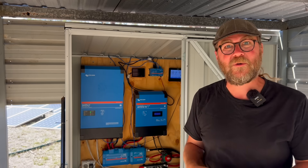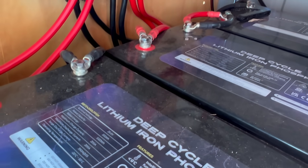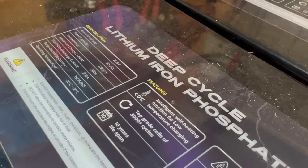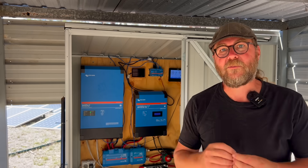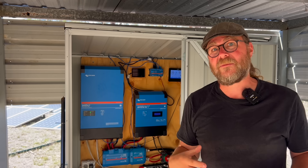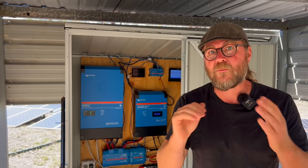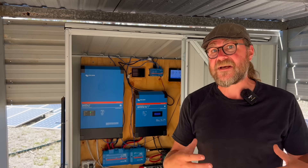Our batteries, for example, were almost half the cost of our overall system. They have a five-year warranty and a 10-year lifespan, and they say they can operate up to 50 degrees Celsius. But why would I want to play with the extreme end of that range? If I know that electronic equipment — and especially batteries — performs better when kept cooler or at a more even temperature, why wouldn't I just try to give those batteries the best environment possible to not only perform more efficiently but also last longer?